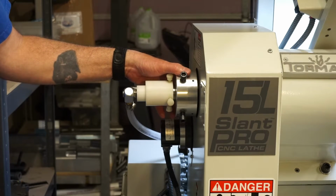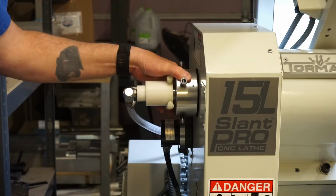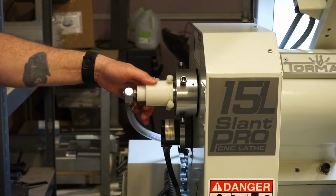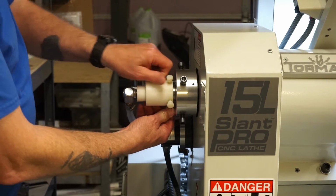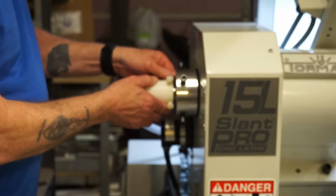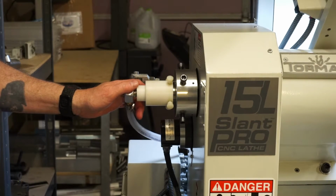The machine has done a number of barrels now, and I always verify before and after the work, and never ever have had one move yet. This is my barrel flushing head that I actually manufacture. Very easy to put on and off. Pull the screws, take them off, pop them back on, tighten it up. That's it. And it doesn't leak. I've tested this one up to about 55 pounds. I haven't had one issue with it.